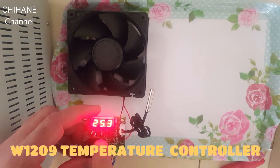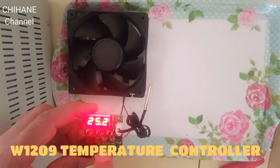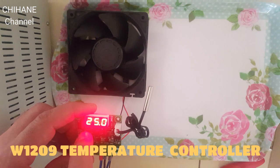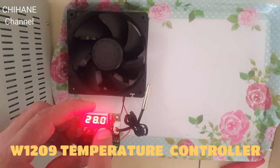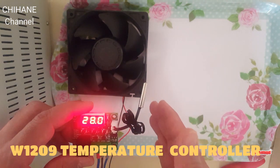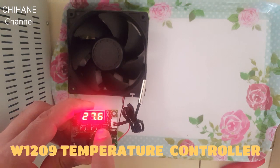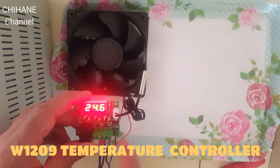As you can see, our room temperature is 25.3. With this module you can set it up for cooling or for heating. We're going to try the cooling system first. I need to press Set once — you can see it's blinking. I'm going to set it to 27, meaning when my room reaches 27 degrees I need my fan to work. I'll press until I get to 27 and press Set to memorize it.